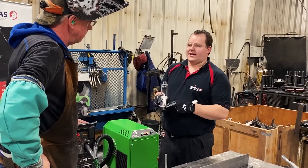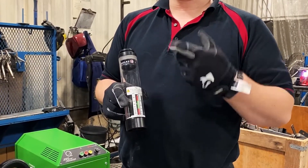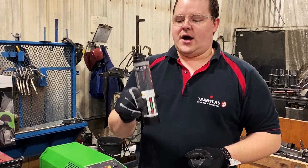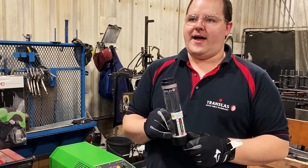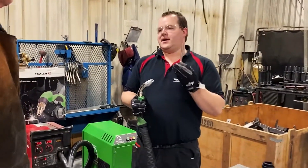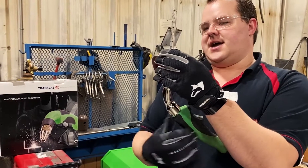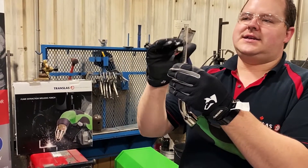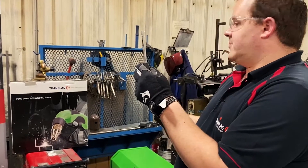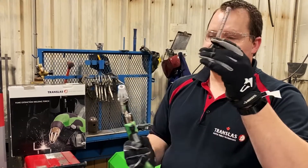So this air flow meter is the first parameter of checking that we're on track for air flow. The second parameter is the gas flow — this is probably familiar, you see gas flow meters already. We need somewhere on here to check the gas. We need 16 to 18 liters per minute, or 35 to 38 CFH. I actually double checked it already. You were set perfectly at 16 liters per minute, so we're going to try it at that. That's the second parameter.